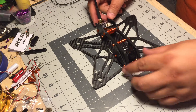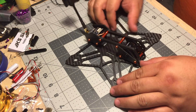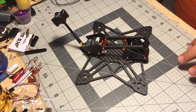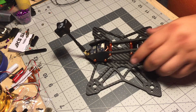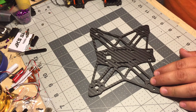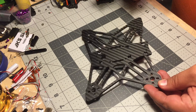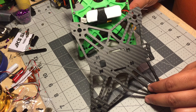I actually have two different prototypes, and if you've been on my Facebook page, Space Cowboy Drone Design, you will have seen them. I'm calling this the Comet 170 — it actually grew in size. The original was designed for 3-inch props and under 250 grams; this one is designed for 4-inch props and 2204 to 2206 size motors. The base plate is 4-millimeter carbon, nicely made by Armitan, and it pretty much follows the same layout as the original.